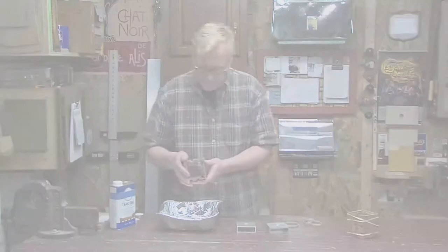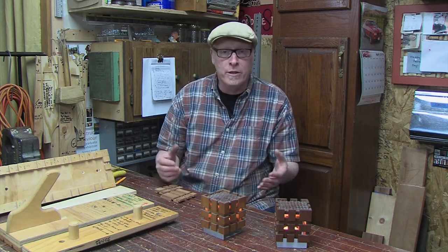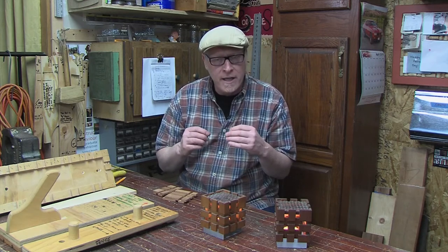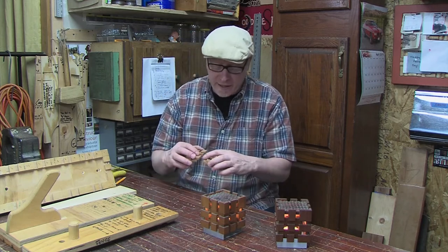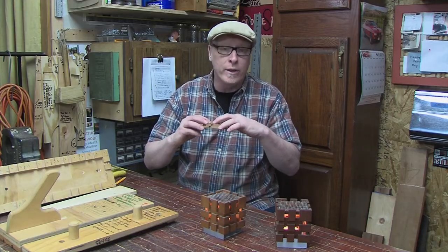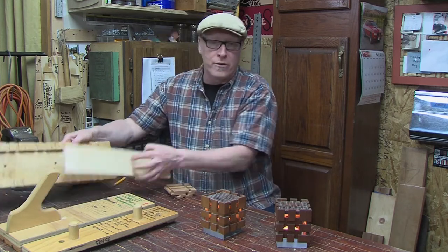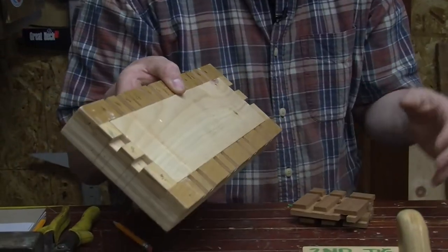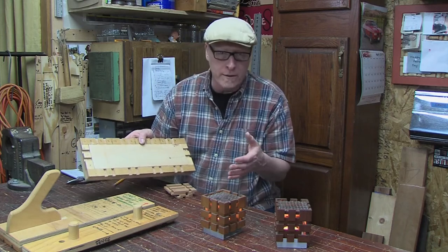They're not complicated to make, but the first time trying them you might want to try a lesser-value wood — maybe pine — because if your dimensions are slightly off, it doesn't leave a lot of wood and it can easily snap. For instance, when I was making the second series of dados and grooves, it was just slightly off and when I took it out of the jig it just snapped apart on me. Normally at first I'll use a piece of pine, dimension it to fit in my jigs, and start from there. We'll try one out and work out all the measurements — even having done it before, I have to reacquaint myself with that.